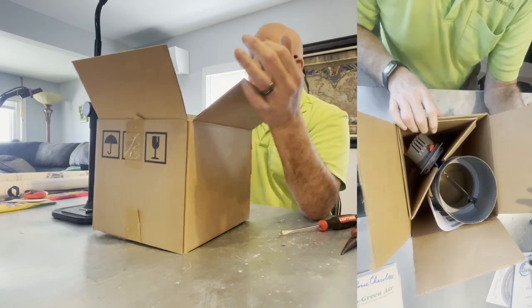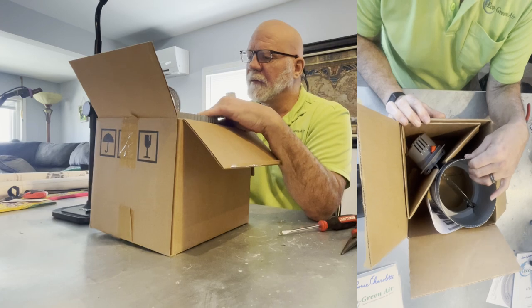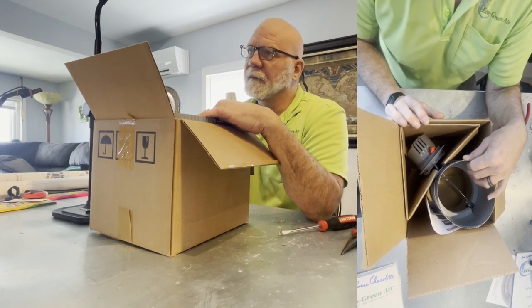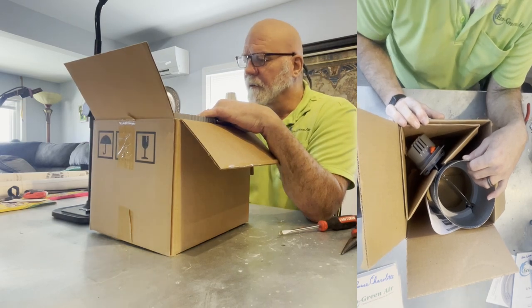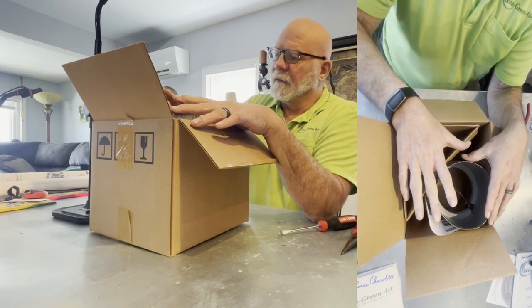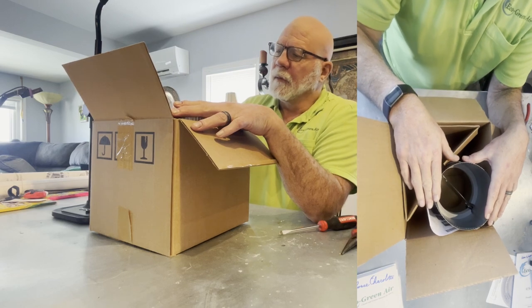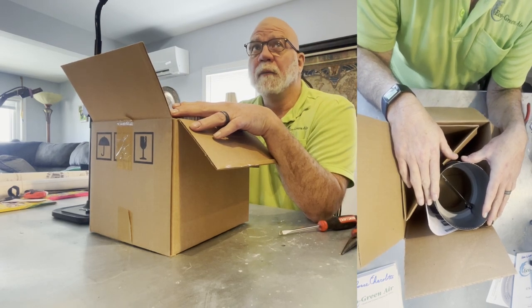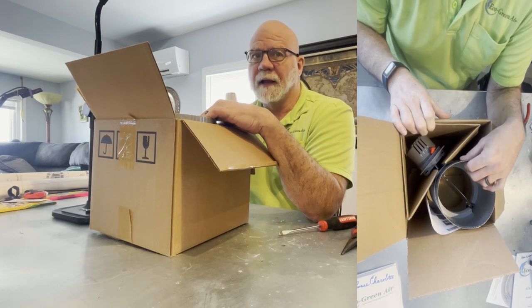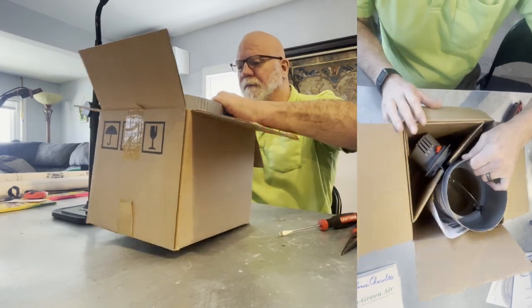closed. And the reason why we would want to do this is mostly, if we get this damper and we need to install it on a fresh air intake for a unit, a commercial unit, this is a 6-inch, but normally we need a 10 or a 12-inch, and they don't make the normally closed dampers past 10-inch. So you have to get one of these and convert it.